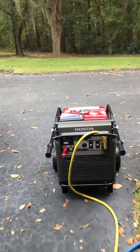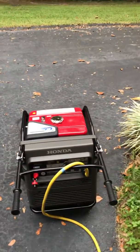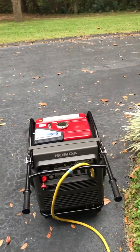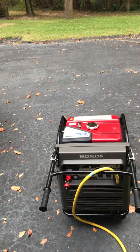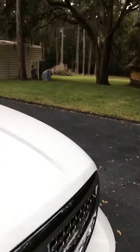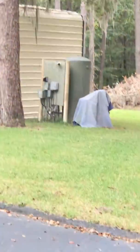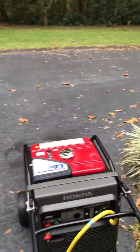This is with the air conditioner off — I'm only using 650 watts. To start it, I have to put it in full run mode, not low idle. It also runs my 5-horsepower well pump out there. But I have to start the big unit with everything else off in the beginning.